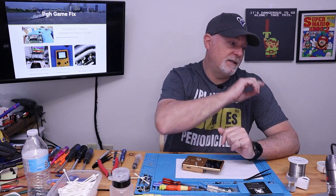Now, in this case, you want it to be snug so that screen doesn't move around. But in this case, they could have just taken a few thousandths out of it, like 20 thousandths, and just used some double-sided tape or a small piece of foam in the back to hold everything tight. Because, let's face it, glass and clamping with aluminum isn't necessarily the safest idea.